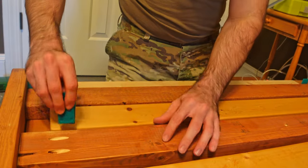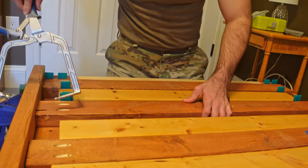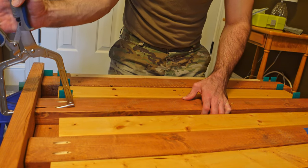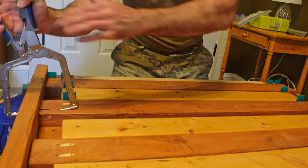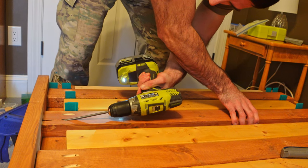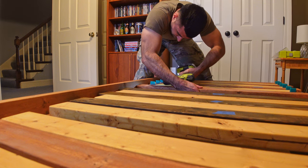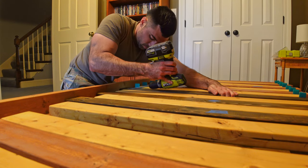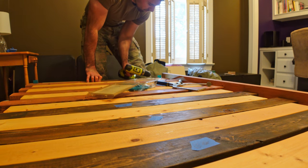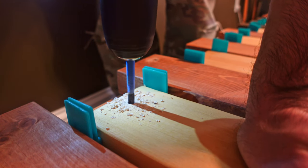To resolve the problem, I ended up having to remove two of the slats - one from the base and one from the rollout section. This freed up 7 inches of space, which allowed me to increase the gaps between some of the slats to accommodate for the warped boards. But I had to go back and redo all the math to ensure that the spaces were essentially equal across all the slats, so you wouldn't have one particular area with a particularly large gap where the mattress could be pushed through the slats because it didn't have enough support.